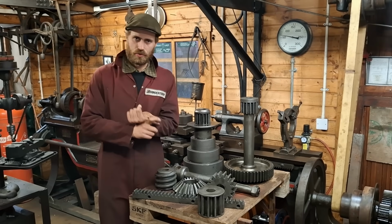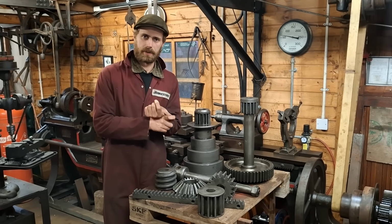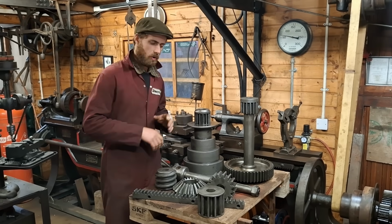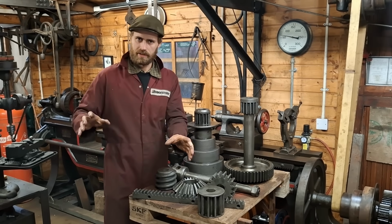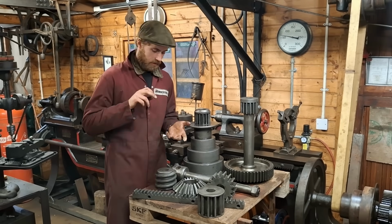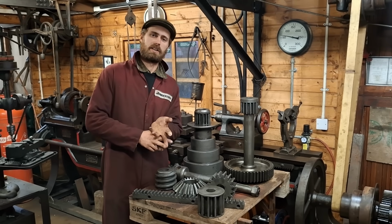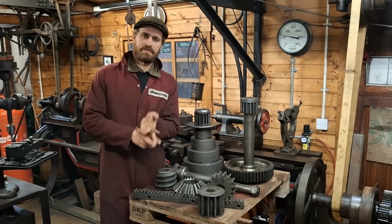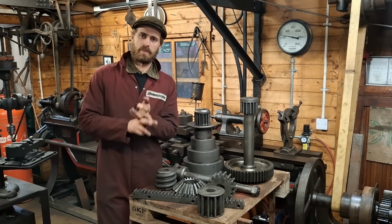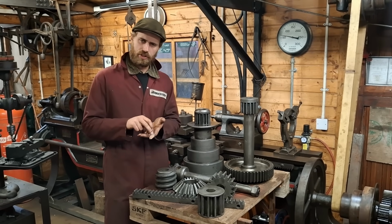Oh, it's obviously extremely cheap, so I mixed up that blue barrel for less than 35 quid. Evaporust or any of the other commercially available liquid dips just can't even come close to that cost-wise. The other big advantage is that it is obviously completely organic. It's just sugar. It's safe to deal with and very easy to dispose of. That's pretty much it for upsides, to be honest, because it's extraordinarily slow.